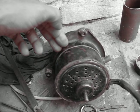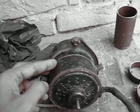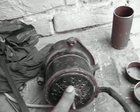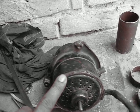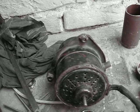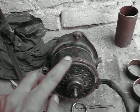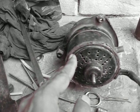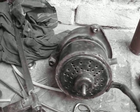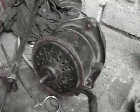That ring will have a collar right here, here, and somewhere over there. And that collar will have a screw coming over here. The same way the motor plate will also have a collar, and that's how I'm going to screw it on. So I wouldn't be having this bent metal to hold the motor. This way it's very difficult to open the motor. When it has screws, it will be easy to open the motor again and then fix it back again — it's going to be easy for me.